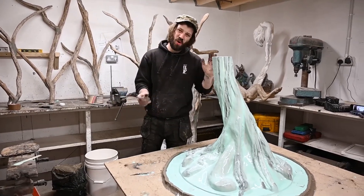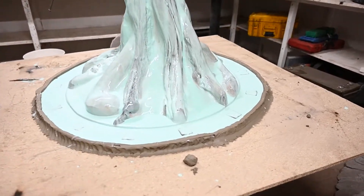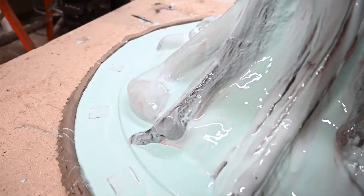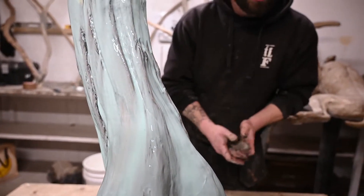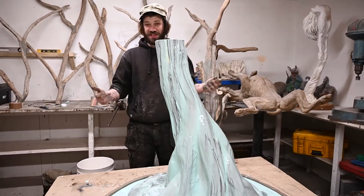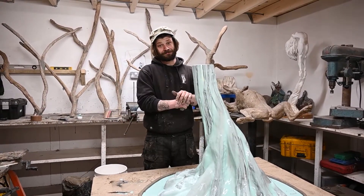I've put all of my flow coat onto the piece. It's filled up the moat and covered these little locator buddies — I've just let them skim the surface so you can still find them. Once ready, you just peel away the top, remove the clay, and you're left with a little void. When it's time for the jacket, we fill these voids with thick resin and lay fiberglass on top. Before any of that, once this has gone off, we need to put our shim on — our dividing line. So we can't do much more today — I'll leave it there until the next episode. If you liked what you saw, tune in next time. See you soon!